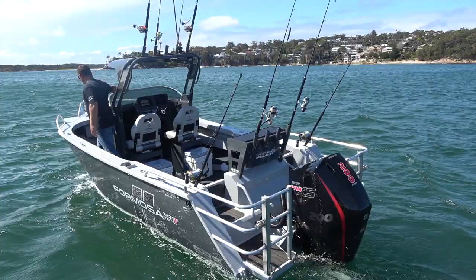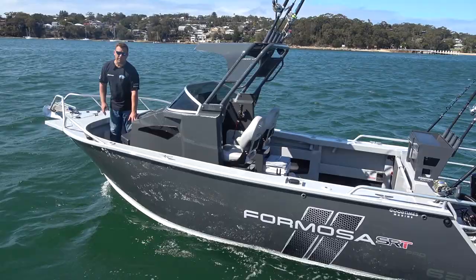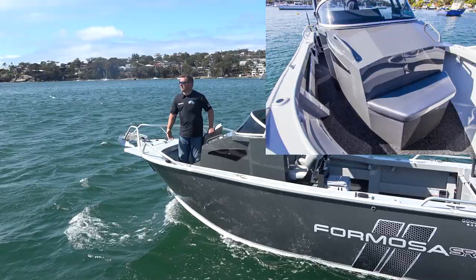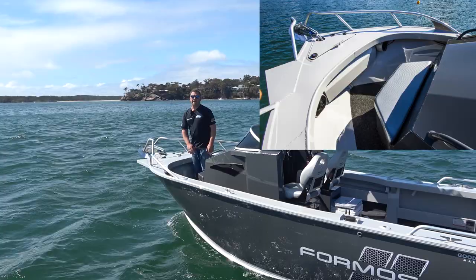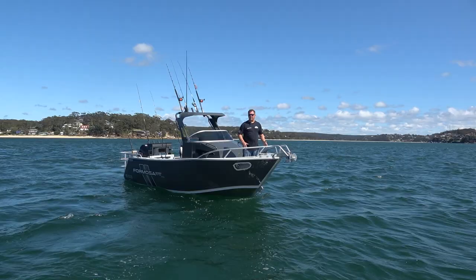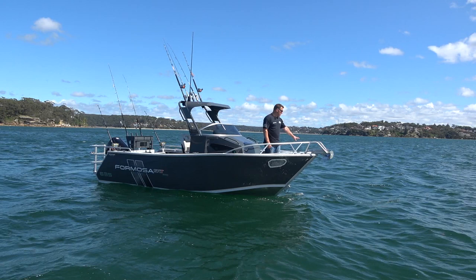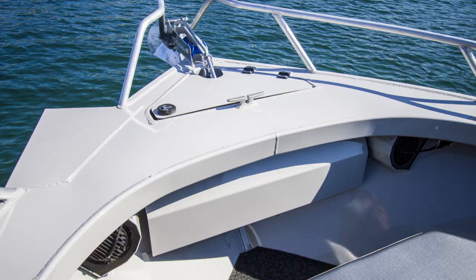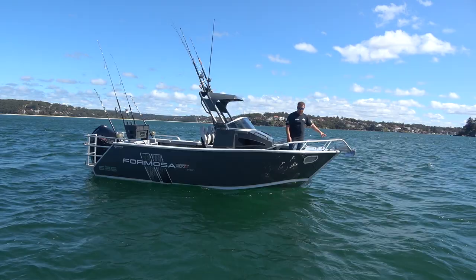Let's walk forward onto the front of the boat. It's a walk-around rather than a true front casting deck, but this little step area here effectively lets you use it as a casting deck — on a calmer day it'd be very easy to stand up here and flick some lures. We've also set these up where guys stand on the foredeck and on the anchor well lid, casting from up there as well. In anything from a 595 or bigger, the anchor winch is really a no-brainer — you don't want to be pulling in a big heavy anchor by hand, and it's money well spent putting the electric anchor in. On the other side we've got the bow mount plate. For this size boat I'd really want to run a 105-pound motor, which is a 36-volt system, to handle the windage, and you're going to need a 72-inch shaft to get the prop and power head nicely into the water.